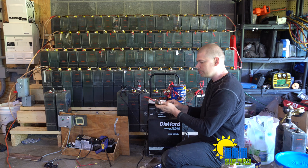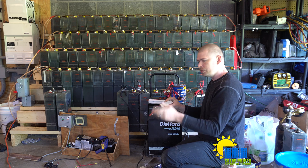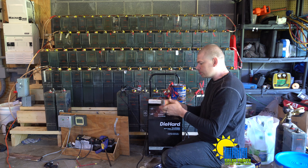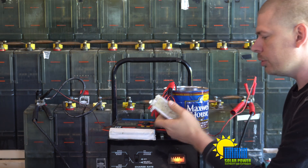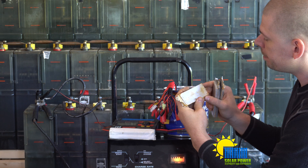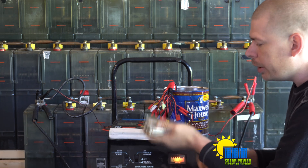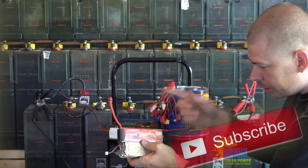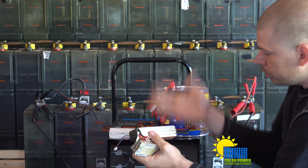For instance, I've got a battery pack that had a terminal break inside of it. I removed the battery cells, desoldered the remaining terminals, and that way I can actually use the cells themselves. Here is a single cell — this is a 3.7 volt cell. This was a 4S battery pack and this was a 2S battery pack, but it's not actually two cells — it's four cells: two in parallel and two in series, which doubles the amp hours.